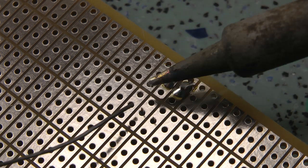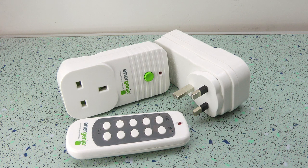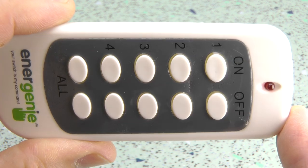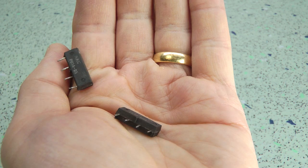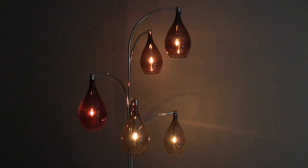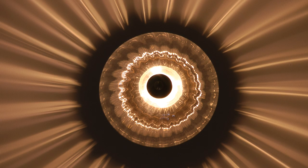The actual mains control is handled by commercially available RF switch sockets. I incorporated the transmitter using reed relays across the existing control switches. The advantage to this is I can control several lamps in different rooms without running wires all over the place.